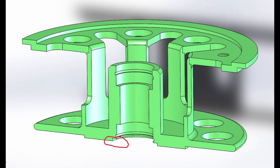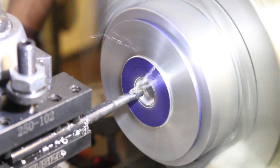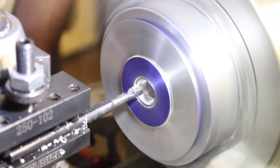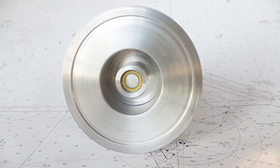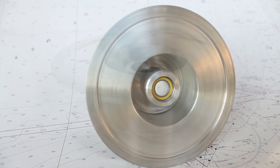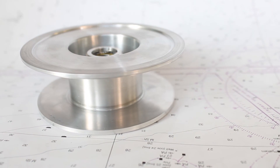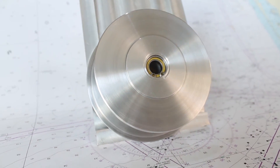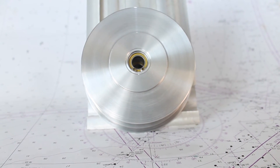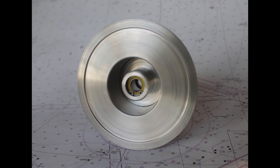The final cut on this side is a small recess to protect the spool from running into the drag disc. To finish out the part, the same bearing bore and retaining ring groove are cut on the opposite side. After the part was sanded down and cleaned up, I installed the bearings by dropping them in place. After something like twenty takes, I installed the clips without them flying across the room. The same bearing assembly is shown on the back side, assembled just the same way. And until it comes time to throw it up in the mill, that's the finished part.